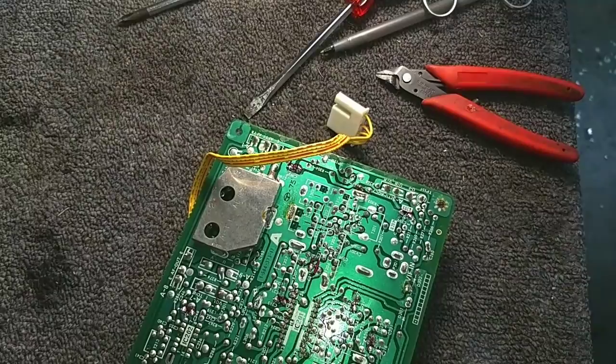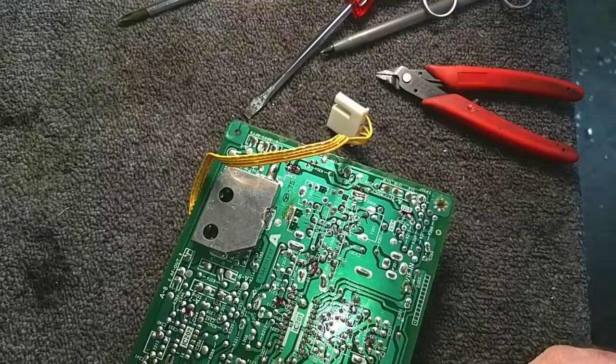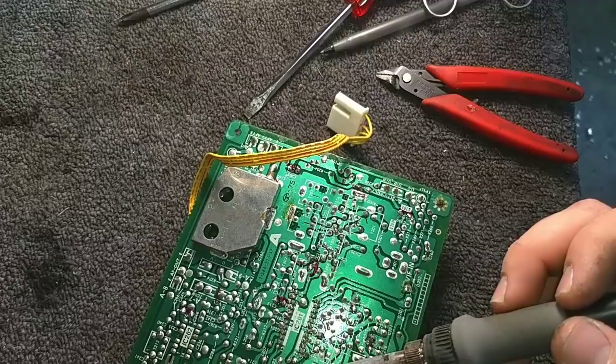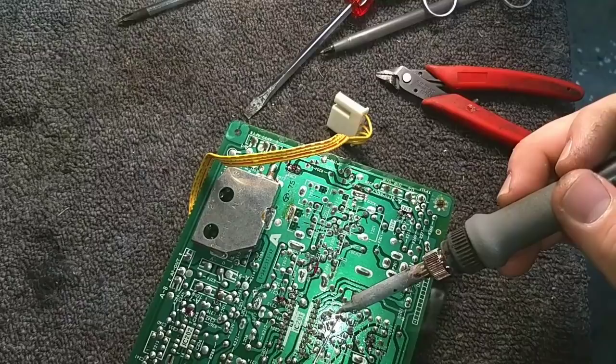And yeah, it's nice gear, it's nicely assembled, it's well put together, it's repairable, absolutely. But I'm just not a fan. The way it sounds is good, but it isn't thousands of dollars good. And the 22 series seems to be, with the exception of a few models, somewhat unreliable. I probably get a Marantz for repair every week. 2270, 2238, 2265, stuff like that. About the only ones I don't see very often are the 2230 and the 2245. Those I hardly ever see.